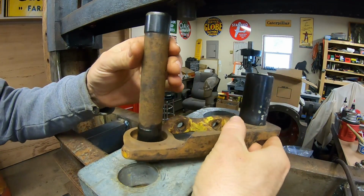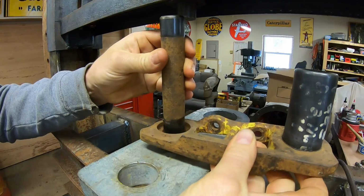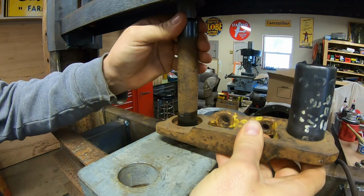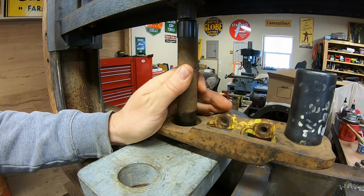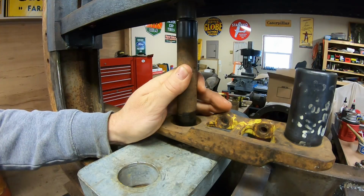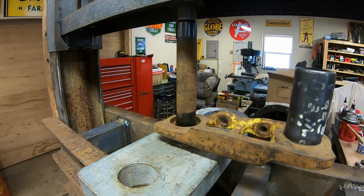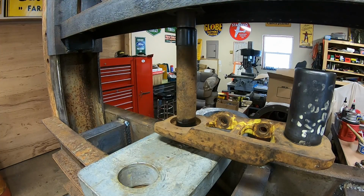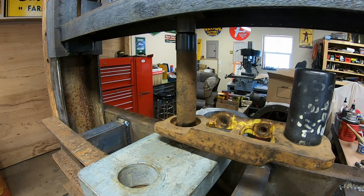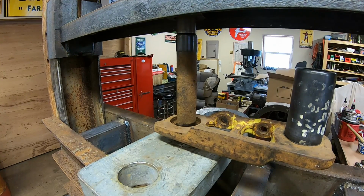Same basic routine as with the bushings. We have the press fit lube applied to the surfaces. Just position the pin correctly in the link and start it in. These don't require as many special tools to get pressed in at proper depth because these pins press in at about 1/2 to 2/3 the tonnage that the bushings require.